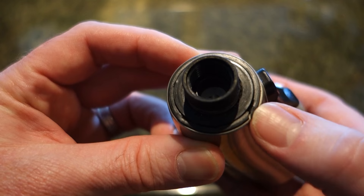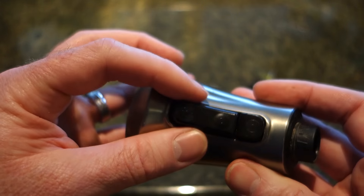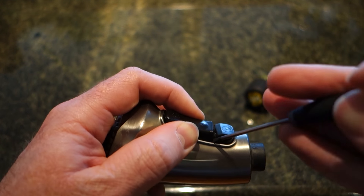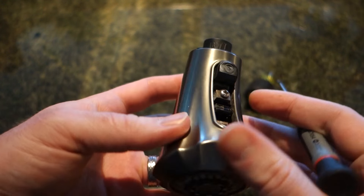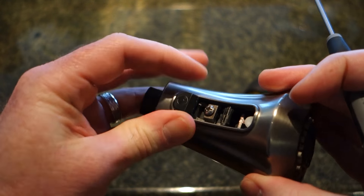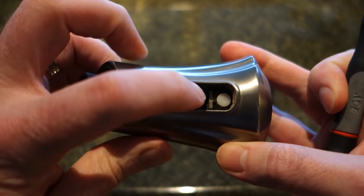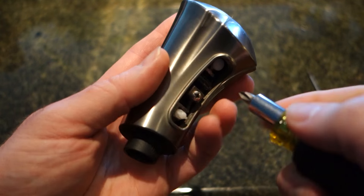You can see I tried initially with the screwdriver. That works but it's not the easiest way, and I found out in good old hindsight. So it turns out these buttons actually pop off. Put a screwdriver underneath and without too much pressure they just pop right out of place. There's a screw underneath — screws are always a good sign on this type of thing, because that means you can probably take something apart a little bit further. So I pop these two buttons off. You can see the two white buttons underneath which the other buttons actually touch.